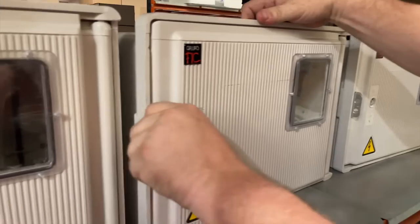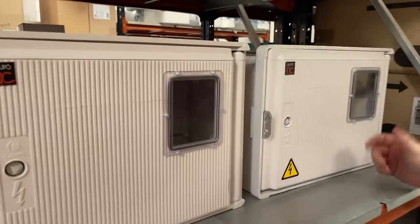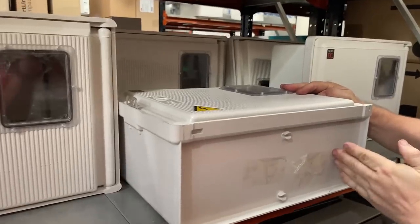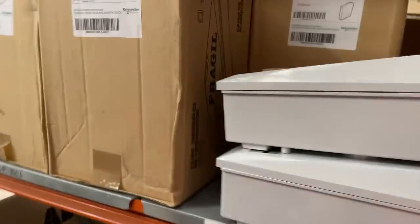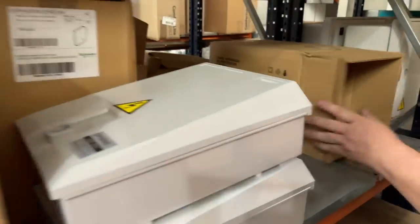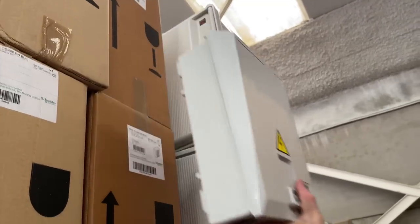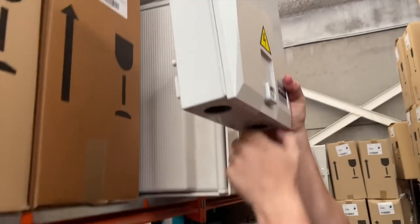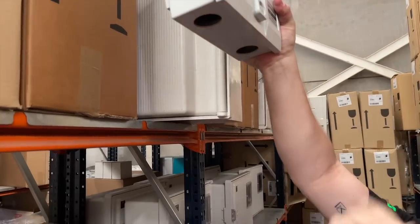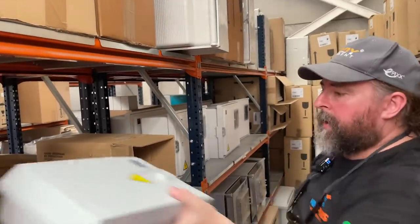These are virtually the same thing, right? Basically the same kind of setup inside, and these get sunk into the wall up to there. So it's our equivalent to a meter box. Okay, so these are for when you have the trenzado cable or the braided cable. These normally go up about 2.80 meters at the top, which we'll see later. The cables drop down into here, supply the switching and the protection, and then drop down in a grey tube with a spiraled metal protection inside, down into the main meter cupboard.